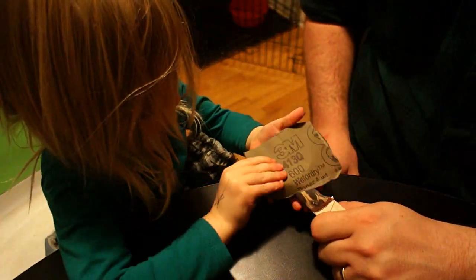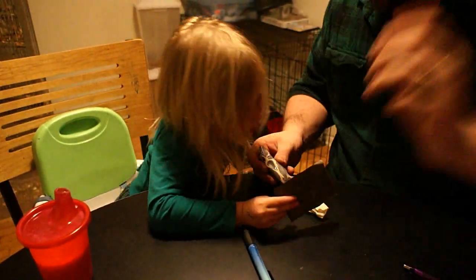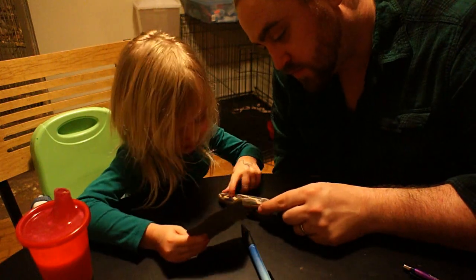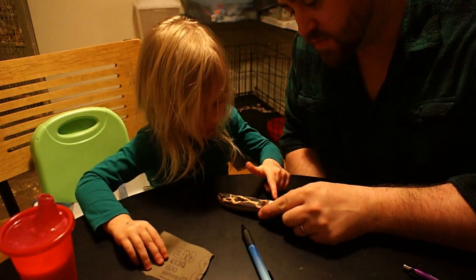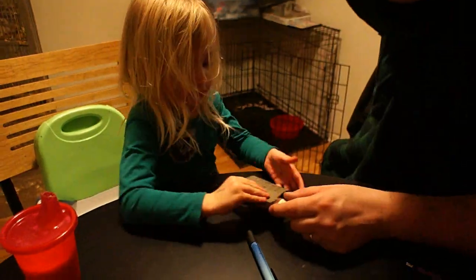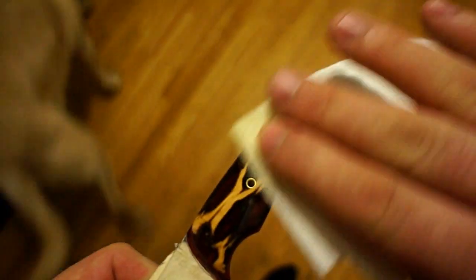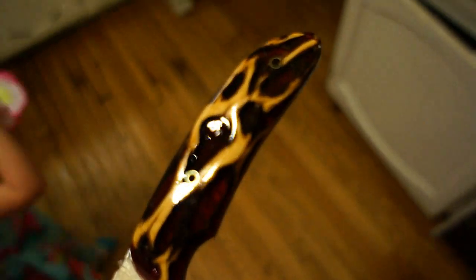It's pretty funny — all the little things they pick up on, like blowing it off. She had seen me licking my finger and rubbing it on just to see what it would look like when it was done, and she thought that was pretty cool to make it shiny. After all the sanding I used a bunch of coats of wipe-on poly — probably about six coats total, with some sanding between coats to get exactly how I wanted it. Looking back it probably would have been easier to use a two-part clear coat like an automotive paint form.